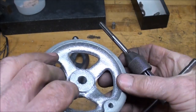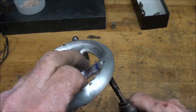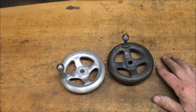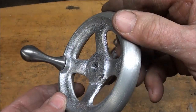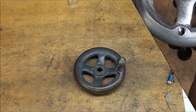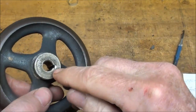The hole is drilled, and now I will tap it one-fourth twenty all the way through. There it is. Weighs about half of what the cast iron does. It's nice to have crank handles that spin, but on the smaller ones we just have friction on our fingers as it turns — you will see the spinning feature on bigger and more expensive machines. There's yet one more step: I need to make a keyway.